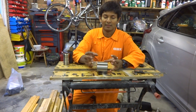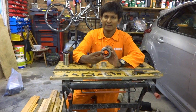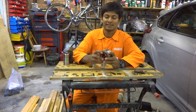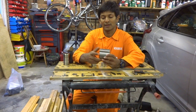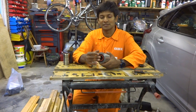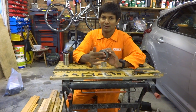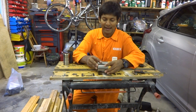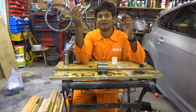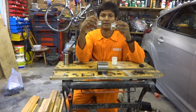Here's the but — in terms of the installation of this system. The way this is drilled into the bottom bracket shell area on most bikes is a lathe operation coming in from one side, then the frame is flipped and drilled from the other side. By having plastic cups, that allows much slacker manufacturing tolerances — you don't have to line the drill bits up as accurately, relying on the plastic cups to take up the difference. If the cups are perfectly aligned, there's absolutely no problem and there'll be no creak.